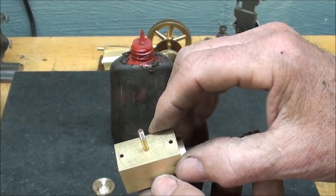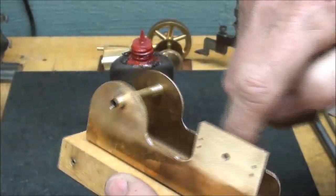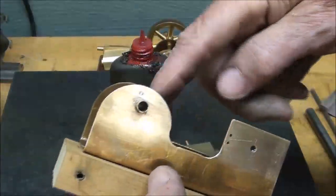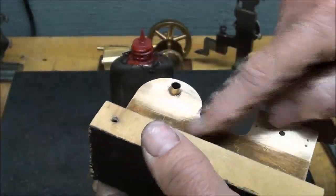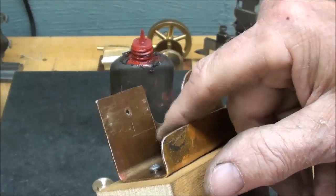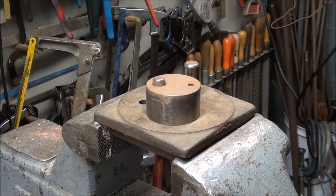With that in mind, I'm also going to take this off and polish it just a little bit with emery cloth, but only to about the finish you see here. I have no intentions of doing anything with the inside — if I had intended to, I would have pre-done that. That'll just be the original finish. I need to deal with the inlets over here, and I'll take a lunch break after I do that. This is how I made the manifold: I started with quarter inch round brass — I suppose I could have used square.